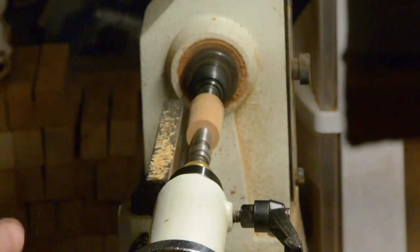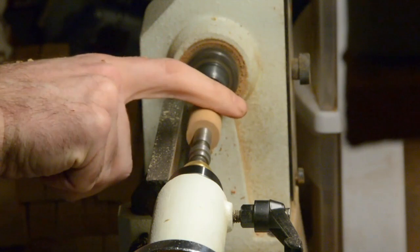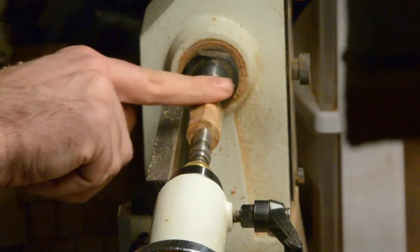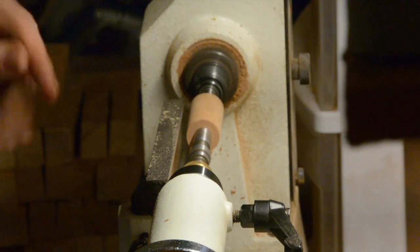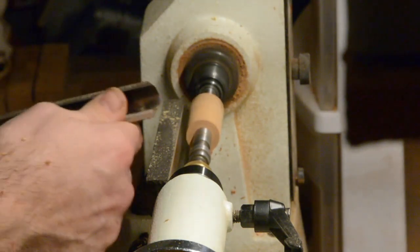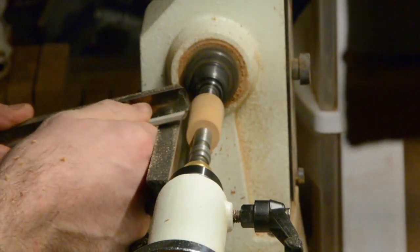This is a half inch roughing gouge, and for your spine, you can actually feel where the ridges are as it's turning. When you stop it, you see all the sharp edges, or the hard edges, still on there, and all the tool marks from just hitting it. Once I get it down to the round, I'll switch tools and take it down with something slightly different.